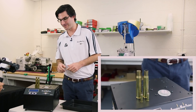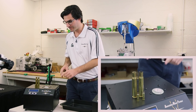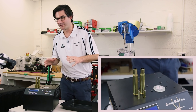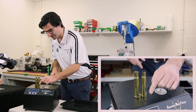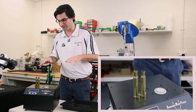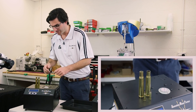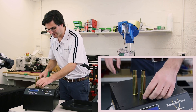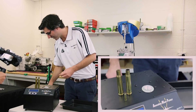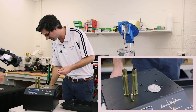As a live demo, we've got some 17 Hornet and some 50 BMG, and we're going to analyze each one to get their codes since we don't know the settings for them yet, then anneal each one after getting its code. Starting with the 17 Hornet — we've already got the correct pilot loaded. The Aztec pilot code for the 17 Hornet is 043A.